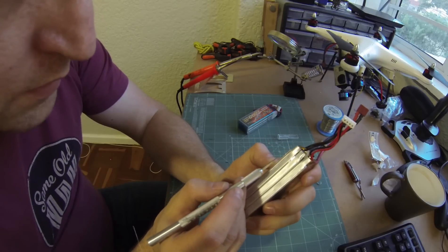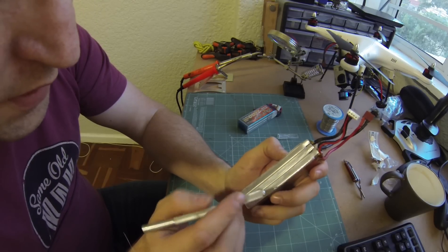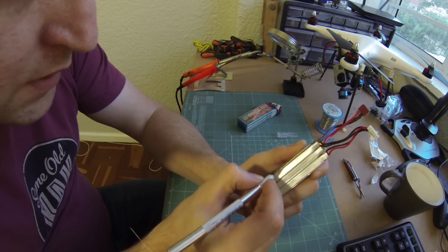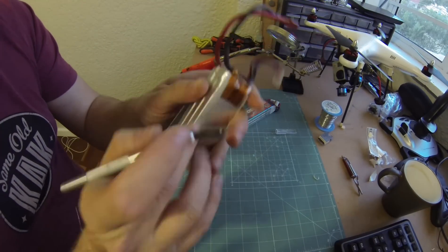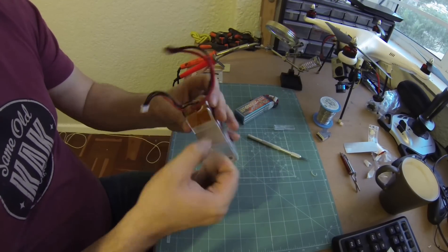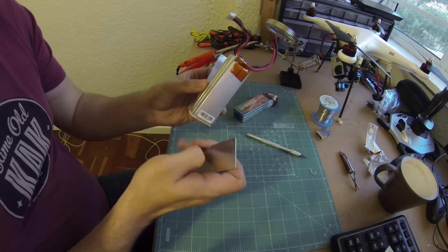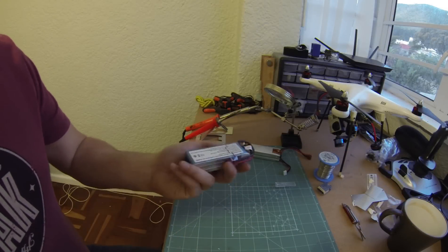Then what I do is cut the tape just through here on either side. Now you want to be really, really careful that you don't puncture this — if you puncture this it's going to become a fire hazard, because when lithium hits the air you're in trouble. These two aluminum plates essentially just go on either side of the battery as protection. I don't use them, but you could. Now I'm just going to continue and do the second battery.